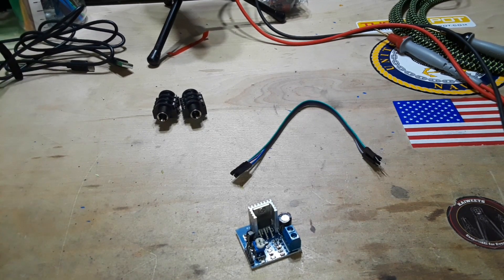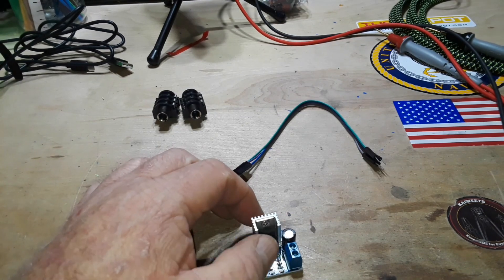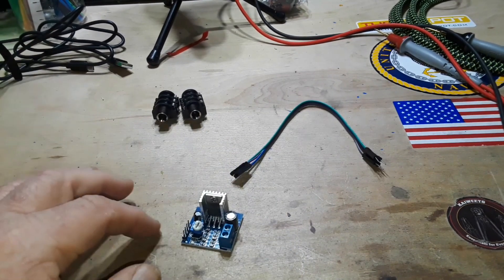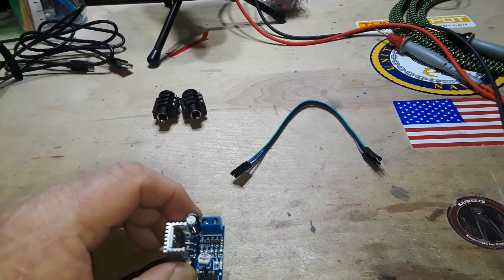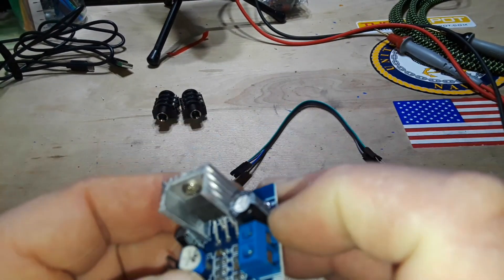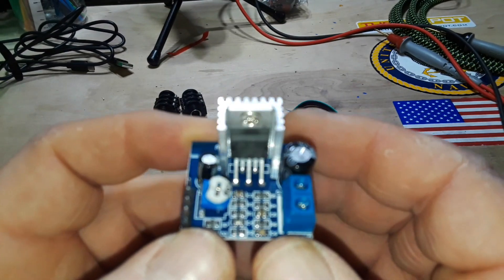I thought that's really cool — I never thought about doing anything like that. It makes sense: fuzz is simply clipping the guitar signal, giving it that noisy sound. So all we need to do is drive one of these little amplifiers into its clipping range and theoretically we should have some fuzz. The reason I want to get the TDA 2030 on board is so I don't have to do all of that manually.